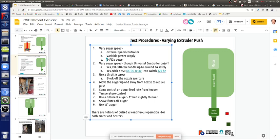Did you know that there's a thing called friction stir welding? No. It's a thing where they have this actual metal tip that literally mixes the metal, at high pressure. You hold something against the metal. It's a big, big machine, and it has huge force. So say you want to weld two things together, it puts a lot of force on. There has to be something against the back if it's like thin steel. It pushes really hard and stirs to get it hot to the point that it's actually welding. So friction is no joke. I mean, you start a fire with two fire sticks, right?